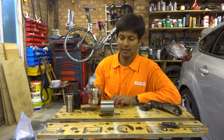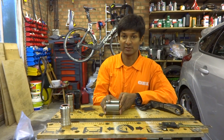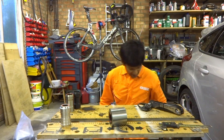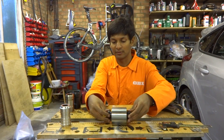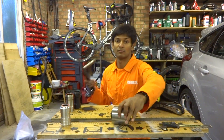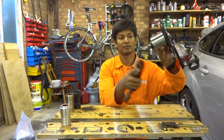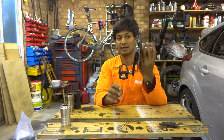If you want to run Shimano cranks with a PF30 bottom bracket, there are a couple of options — really the same as for a BB30 bottom bracket. The easiest method is to use these Delrin spacer pieces. Put those in either side, push them together, and then you can run your Shimano crank through the middle. That's method number one.